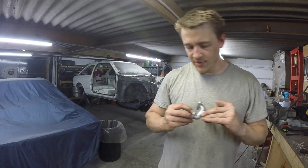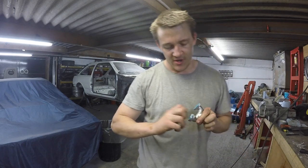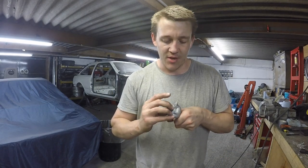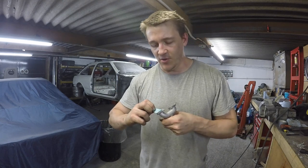Good. I'm happy with that. There's one mod that I didn't do because I thought that's probably bollocks, but it isn't. It's a thing. Pickup pipe isn't very good and everyone was saying that you get surging with it, and you do. You can feel lumps of glass coming up through the gun. So that's something that I want to do next.